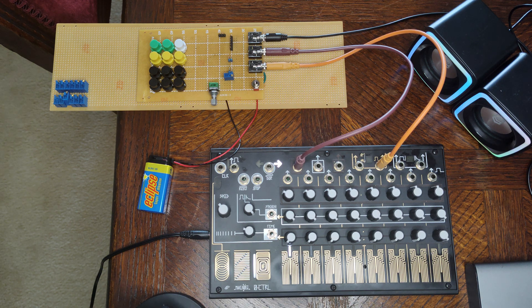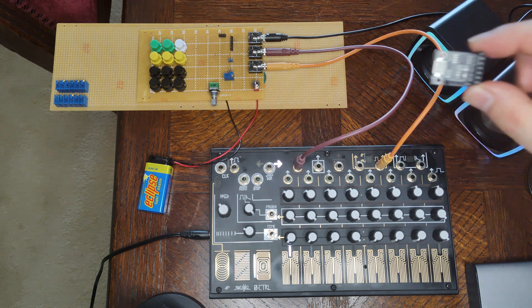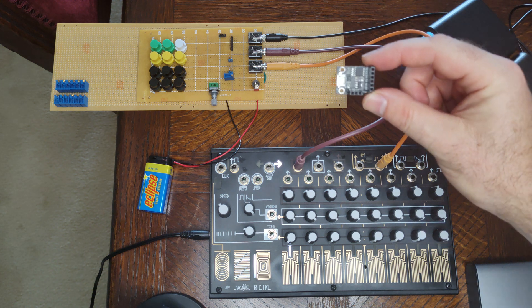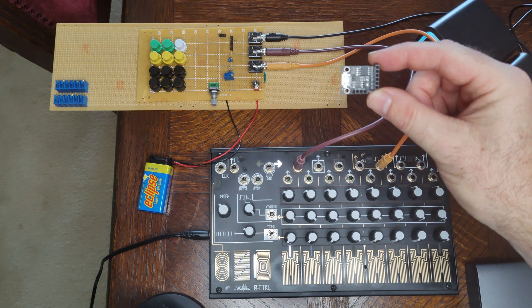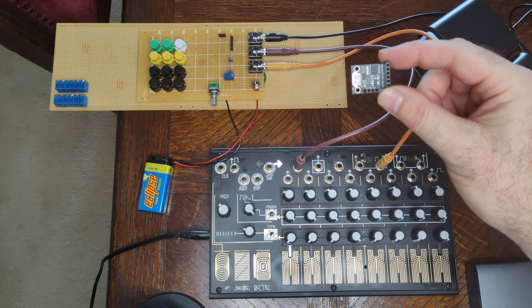This is not finished yet, because I haven't got the buttons completely working — there are some bits I still have to solder on. It's a Christmas project. And this is not a conventional synthesizer you're all used to; this is actually an additive synthesizer. I got probably the smallest processor board — this is an ATtiny85, with 6 kilobytes of flash available and half a K of RAM.